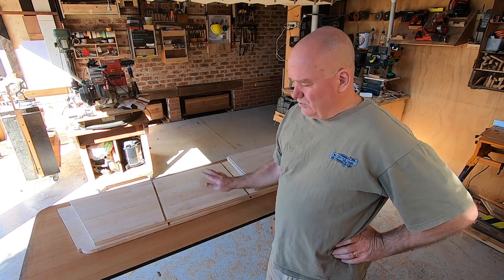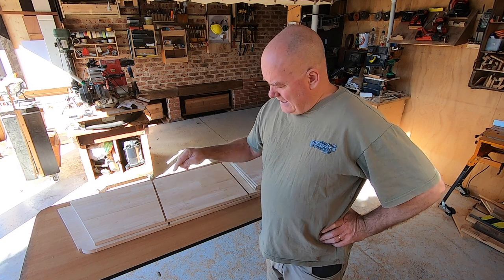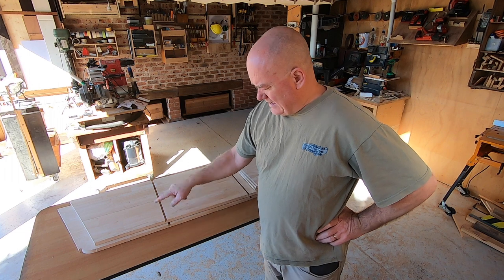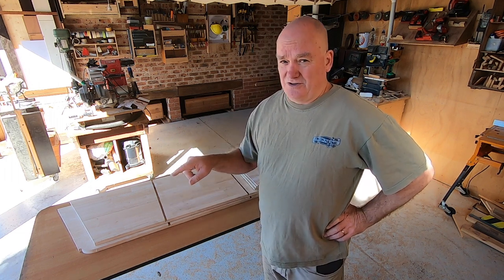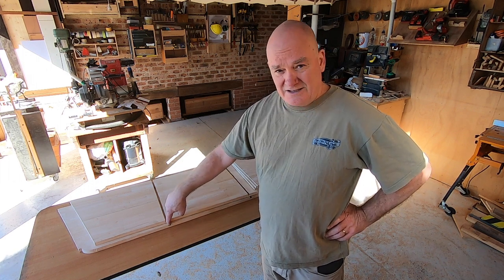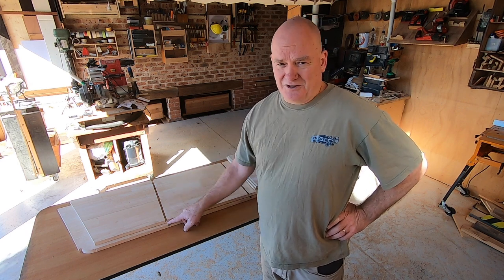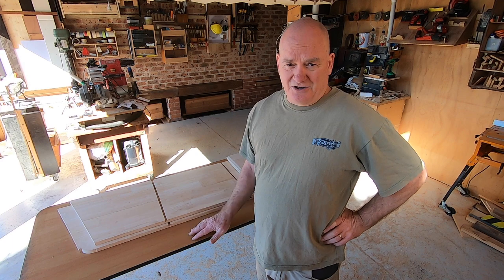What I'm going to do is assemble these shelves — one side with dovetail joints and the other side with screws. I'm going to put the screws inside that groove first, then fill the groove and make it look like it's not there at all.